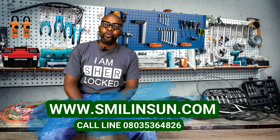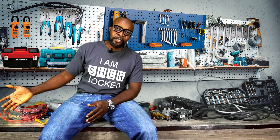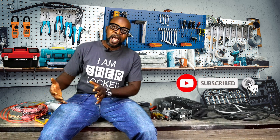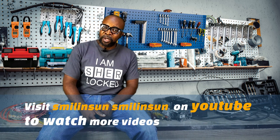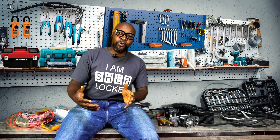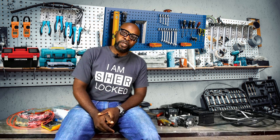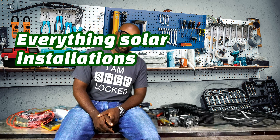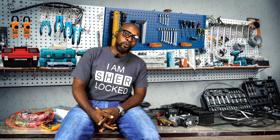Once you have all of that, it will determine how much backup hours you need to provide in your batteries, how many batteries you need, and how many solar panels you need. Without an energy audit, there's every possibility you might under-provide or over-provide solar panels and batteries, which would completely ruin your client's solar and inverter experience. Always do an energy audit before beginning an installation.